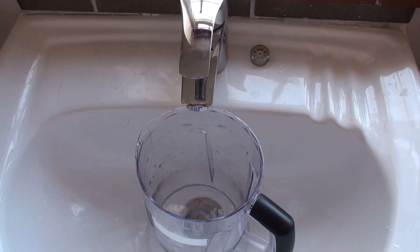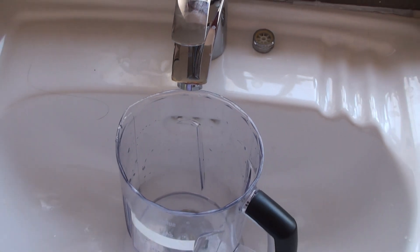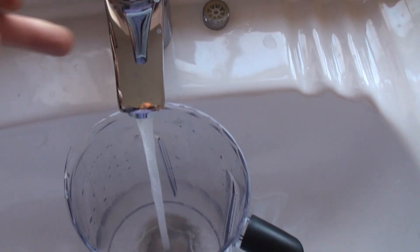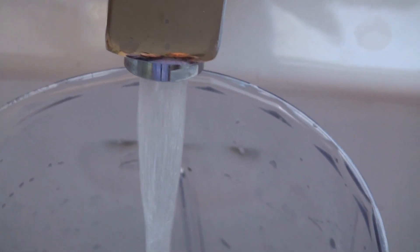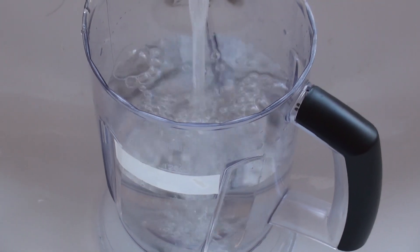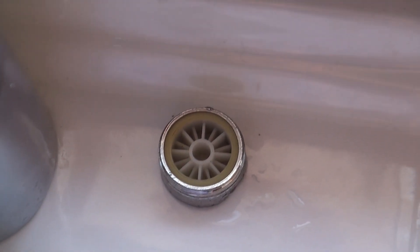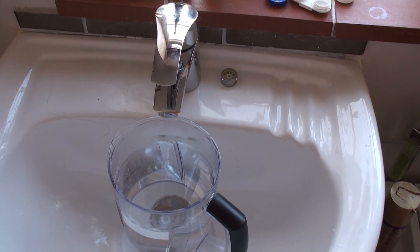It's okay but disappointing. This has the standard stock unit as delivered from Grohe — the only one that came with the tap. So we're just going to do a test. Turn her on — watch — you can see we've got a bubbly, pleasing flow, looks like lemonade coming out of the tap. But how much slower is it? That was 19 seconds — so going from 10 to 19, it virtually doubled the time. It's very usable in this condition, but you're going to have to wait twice as long for the hot water to come through from the tank unless you've got a recirculating hot water system.